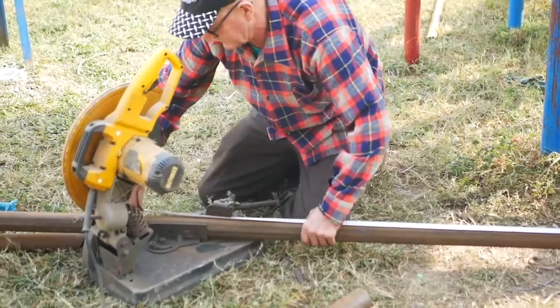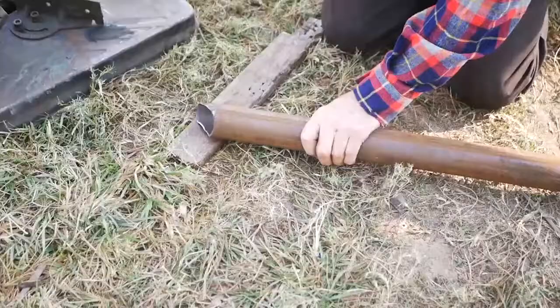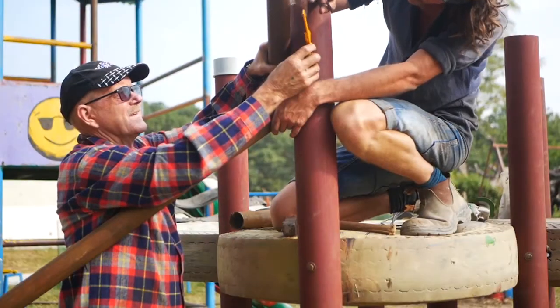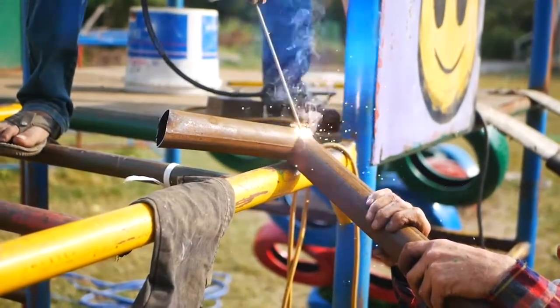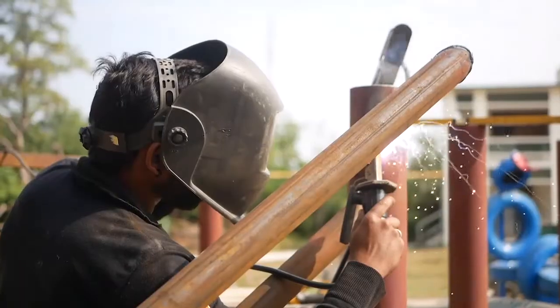These are really simple techniques that you're using for a metal worker, just cutting the pipe to size and then welding it all together. We want to have these two pipes running parallel to each other, do some tack welds on there before everything gets welded up properly. But the most important thing about this piece is to have a really strong weld, especially at that right angle where the top pipe is connecting.